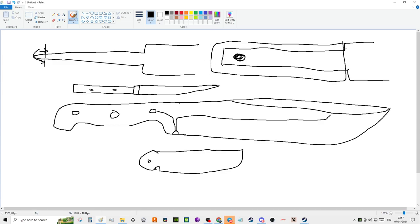blades that are marketed as super tough, which is basically like the SK5 series from Cold Steel, where you have an almost all the way through tang with a little pin right at the back. And imagine you were to make a rat tail and then you just drill a hole here. You would immediately see that as a fault. You would immediately see that as crazy. Why would you want to do that? Often what you can do with rat tails is you peen them. You get that handle really pressed up against that shoulder here, right?